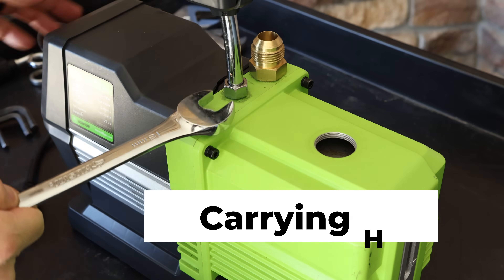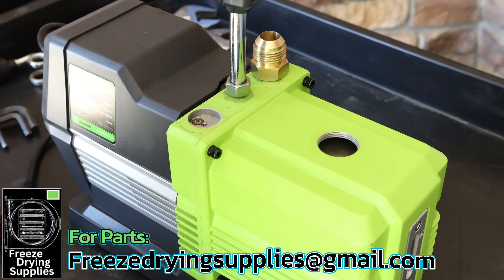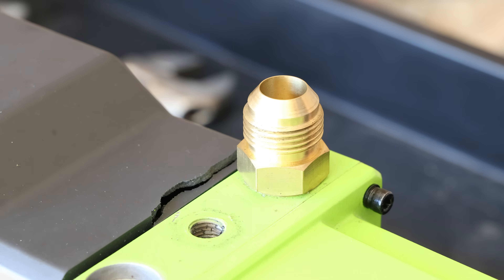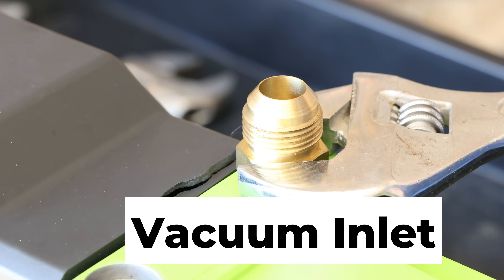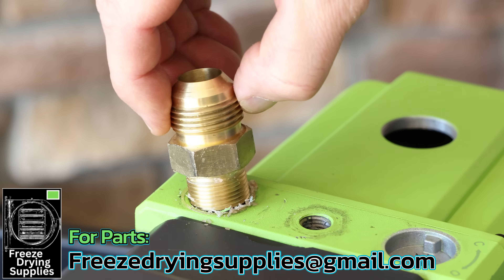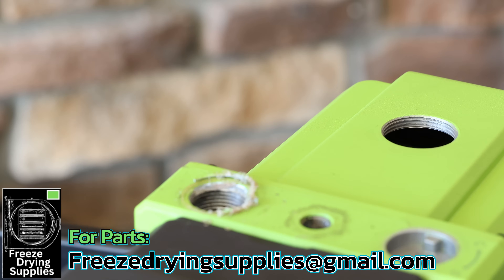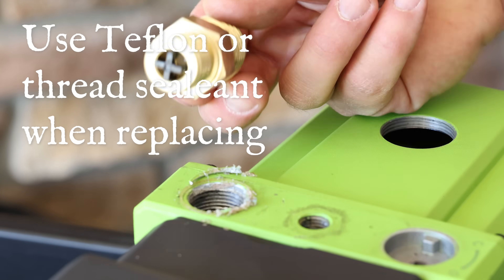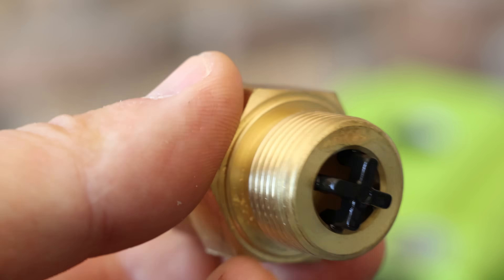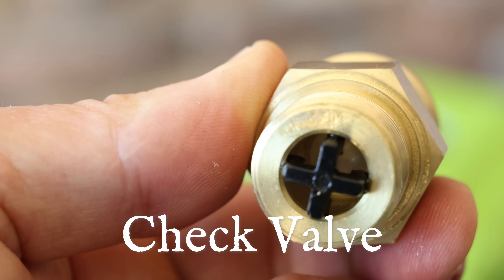Now loosen up the handle — 18mm is what this takes. These can be pretty difficult, but once you get it started, you can use the leverage of the handle to twist it out. Next is the brass gas inlet, which can be pretty stubborn and will need some leverage. If you don't have to take that piece out, I'd recommend against it — it's usually in there with some sort of sealant or epoxy. It will come out, but it takes some brute strength. Once visible, you can see it's actually a one-way valve with a ball inside that allows vacuum to go in one direction but not come back out.